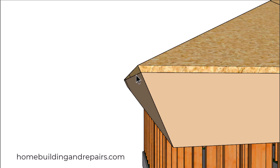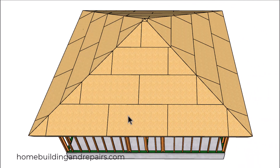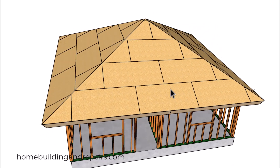With the roof sheathing installed, you can see the edge of the sheathing where it meets the fascia board is going to be nice and square — unlike with plumb-cut fascia board. I don't really think the sheathing layout worked out like I thought it was going to. We could always redo the layout, starting a little further to the right or left to make it work better. I'll include the first video in this series — make sure you watch that if you're interested in learning more about the floor plan layout.